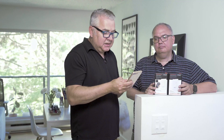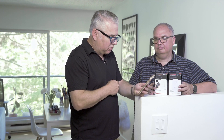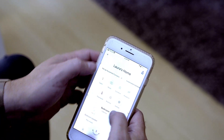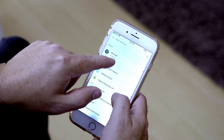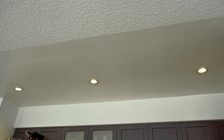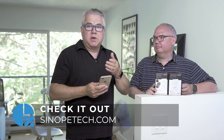Now Laura can control these lights remotely — for example, if she's working late she can turn them on so people think someone's home. The next step is connecting to Google Home, which is pretty easy. Go into the Google Home app, navigate to devices, and add them. Once both switches are in the Google Home app, you can control them by voice. 'Hey Google, turn the kitchen lights on.' There they go. 'Hey Google, turn the kitchen lights off.' So there are a few steps: get it recognized in the manufacturer's smart home app, then add it to your smart assistant — whether Google Home or Amazon Alexa.